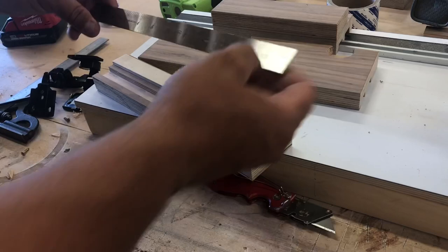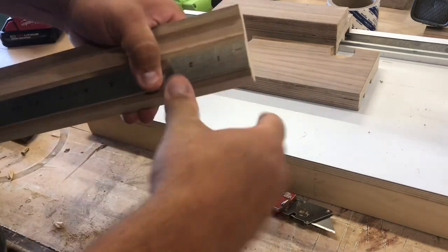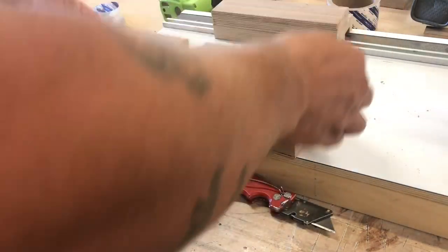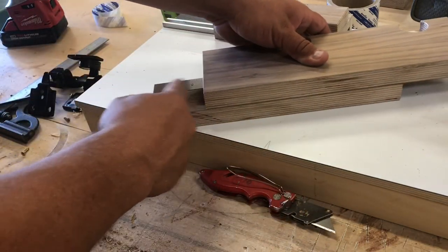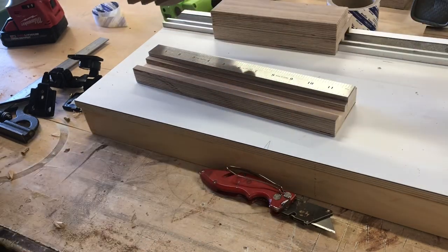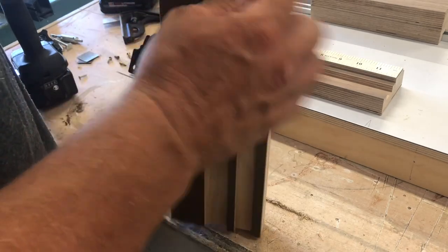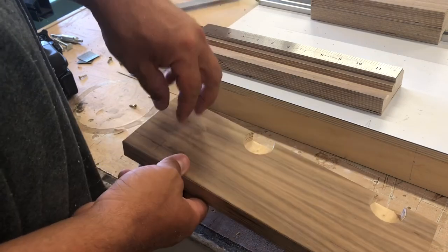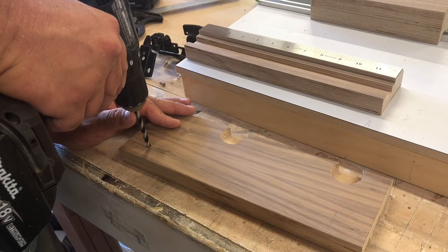Remember, I'm going to register it this way. So my metal ruler — that's what determined how big I was going to make that dado. What matters the most is it's flush on this side. Sits like that, nice and flush, and then when you slide it out that'll give me my gauge mark on this side. I just got to put in this metal track and drill the through holes. I carefully marked the center — an inch and a half in — and that inch and a half will make sure I don't collide with this back knob for height adjustment or with any of the hinges. You have to be center to make it slide properly.